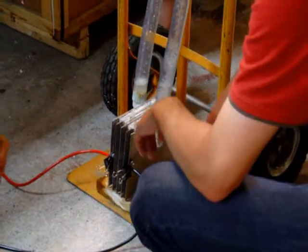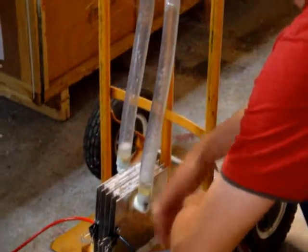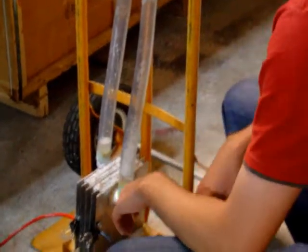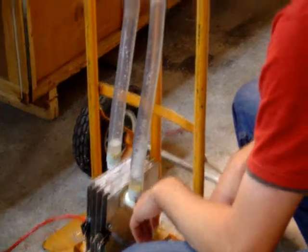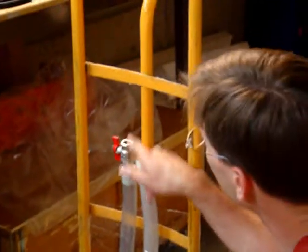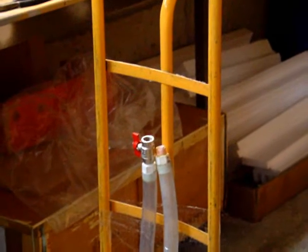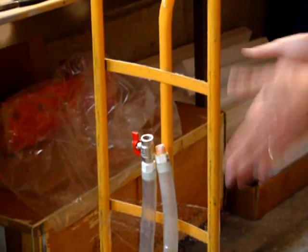That's the electrolyzer built. The plates are stainless steel, and acrylic separators with mesh weave in between to separate the oxygen and hydrogen from one side to the other. And amazingly enough, hydrogen coming out to sustain a flame sitting on the top there, which is not bad going. About 400 to 500 watts coming out of our power supply. Mythbusters! Right! We're going to kick their ass.